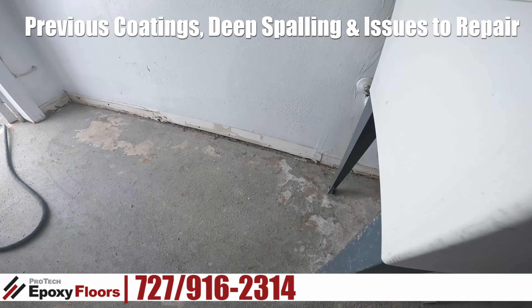This is the first step in getting the epoxy onto the floor. Here I'm pulling out small ribbons and getting the first distribution of epoxy. This will sit on the floor for a minute or two before I start to rake it out. Now I'm going to use a gauge rake to further distribute the epoxy — this is really where the epoxy begins to get even, and it starts to fill smaller cracks.